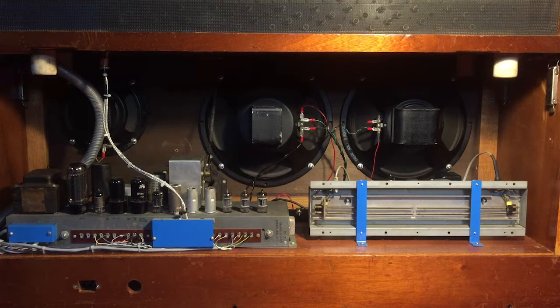So if you are doing this mod, do it at your own risk. You need to know how tube amplifiers work, at least the basic stuff. Because if you don't have a load — like your speakers, or a load like a resistor that I have on my speaker bypass — you're going to fry your amplifier. So yeah, it is not good.